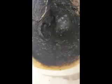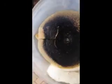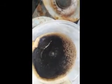So there's a bit of residue, as you can see, in the paper, and I'm thinking if I go pouring that in, getting more into there, it's going to be too hard to actually get this residue clean. I need to make sure that I've got all the gold solution out, and if I pour a whole pile of residue on top of that, it might not actually thoroughly clean. So I'm going to use my rinse bottle here and just rinse this down, making sure that all the gold solution comes out of that particular bit of residue before I go pouring more in.